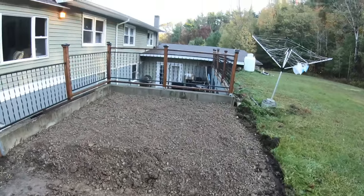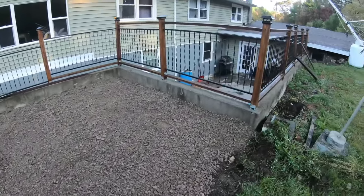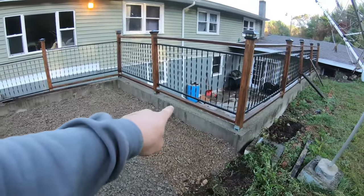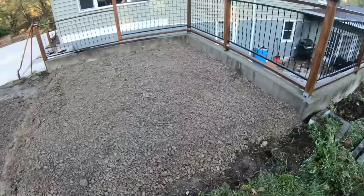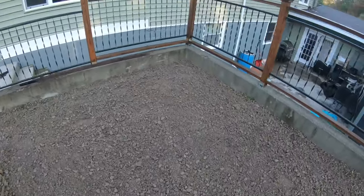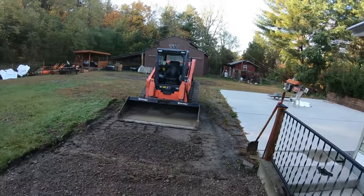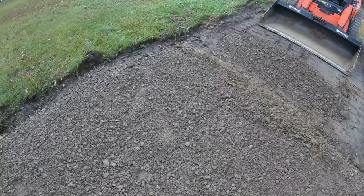As you can see, the slab, monolithic Alaskan slab, starting to shape up. It's gonna have a 10-inch to about 12-inch haunch all the way around. We're pouring to the top of that concrete. I'll put a 12-inch form here, 12-inch form there, and then I'll get some fiber mix, maybe throw some wire mesh in it or something. But I'm going to tamp this right now. I'm going to drop the machine back off, grab my van, tools, tamper, get this thing rocking and rolling.